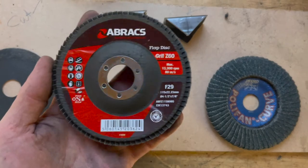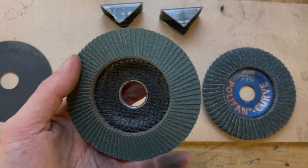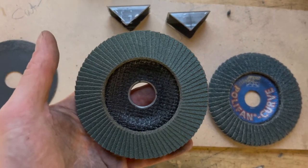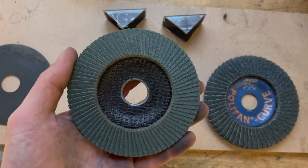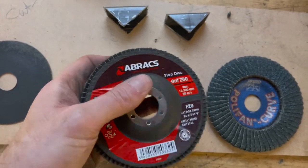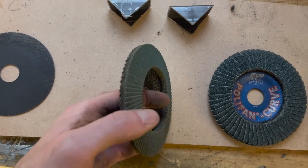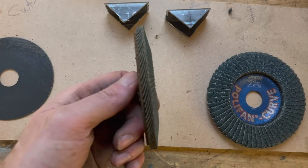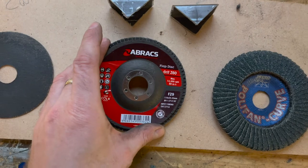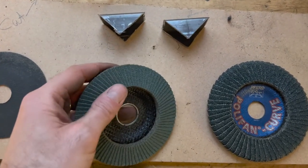Now, I spent years and years and years using a solid grinding disc to prep metal, and you just take too much material away, especially if you're not working with new metal, like a rotten motorcycle, for example, then they're just not ideal. These are brilliant. So if you haven't seen these before, I call them flappy discs. I think the actual name is flap discs. Let's have a look. Yeah, I'll put a link below to some generic ones to make them easier to find.